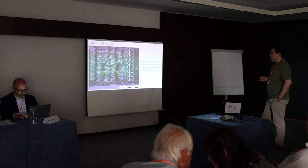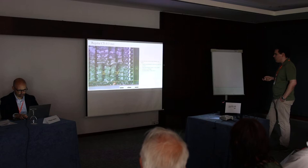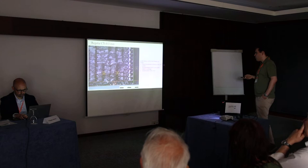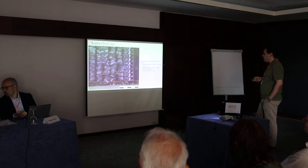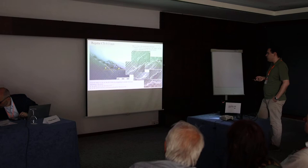Then, according to some optical microscopy, here on this 0.3 millimeter, we see three different structures in this one area. We see a near homogeneous structure in the outer surface, but in the inside, we see some through-thickness holes, which go from one side to the other. They're quite big and they'll influence the results, surely. And in the third section, we had the smooth surface of the pre-crack. So on this 0.3, there is quite an inconsistency. There should be quite an inconsistency in the results.